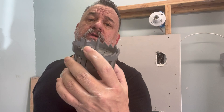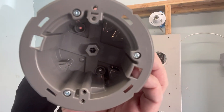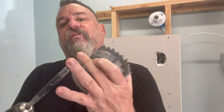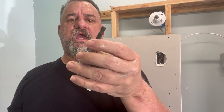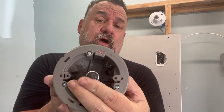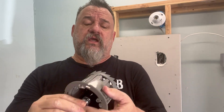At first glance this looks pretty neat — no need for a hole saw. It didn't come with any directions. All I see is a hex head or something for a Phillips screwdriver, but you'd be there all day with a Phillips. I tried a nut driver socket — not made for that either. Then I tried a number 14 metric socket and that fit like a glove, nice and sturdy. I'd think they'd include something more user-friendly for homeowners or beginners. But let's give this a try and cut that hole to see how well it holds up.